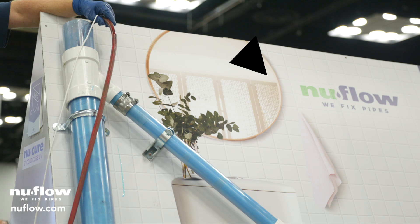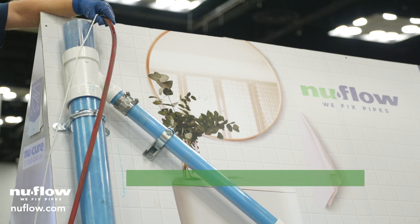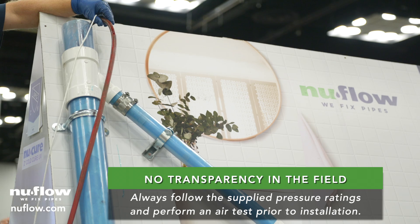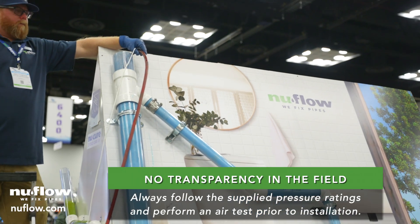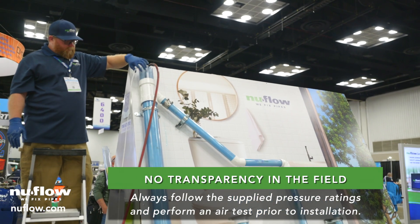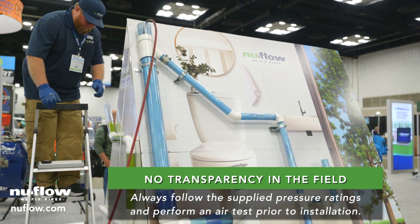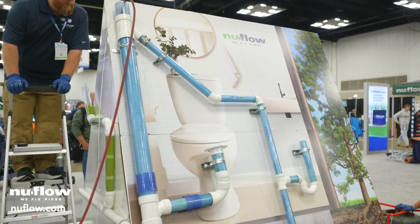The final piece of tape just popped. If it were inside the pipe, you're not going to see that — you're just going to deflate and re-inflate. We've never had it so that you end up with a tape bulge there unless you go more than once around on the two-inch. That's not supposed to go around more than once. On the two-inch, you only wrap once. On all the rest of our liners, you'll go around twice.